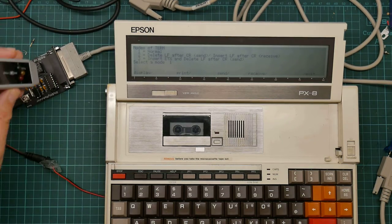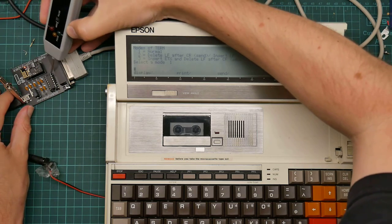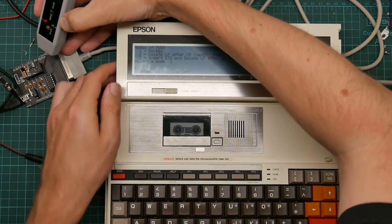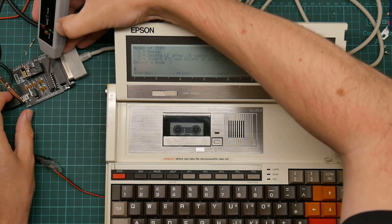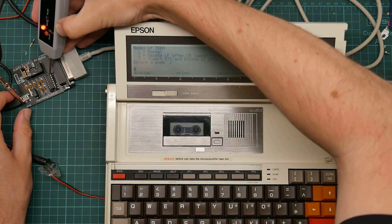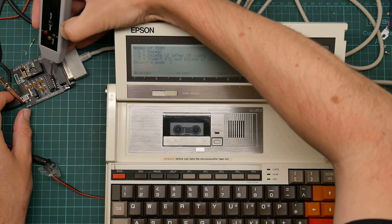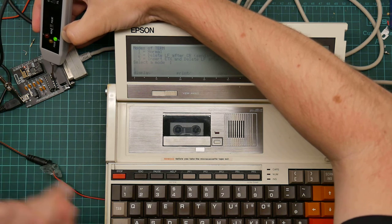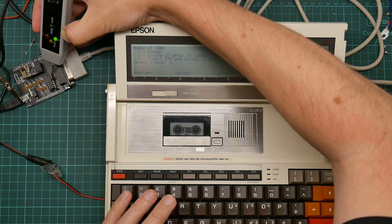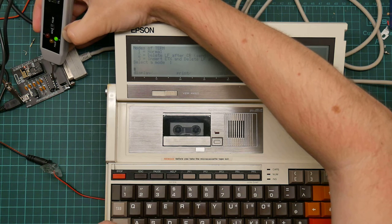Okay, the logic probe is now enabled. Let's just try these pins, just to check. I have to keep the screen at exactly the right angle or it's not visible. Right, logic 1, correct. Logic 0, correct. This one should be incoming data. Oh-ho! Blinkin' lights.